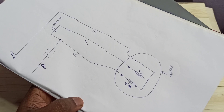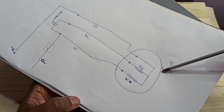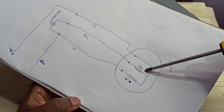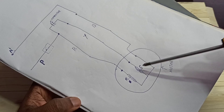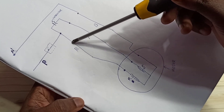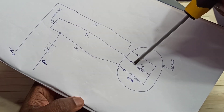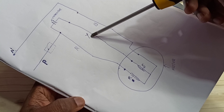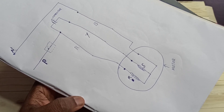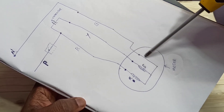This is a circuit diagram. Here you can see one circle — this is the motor. Inside this motor you can see two windings: one run winding and one start winding. From the run winding, there is a red cable coming from the motor, and from the start winding, there is a yellow cable coming from the motor. There is one more cable coming from the motor — that is the blue cable.